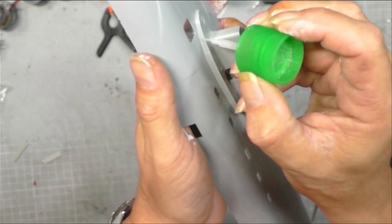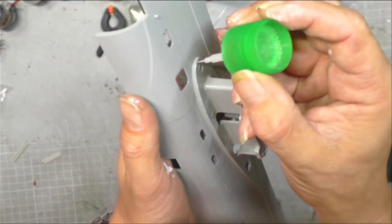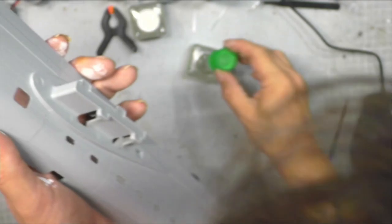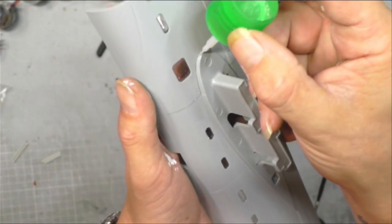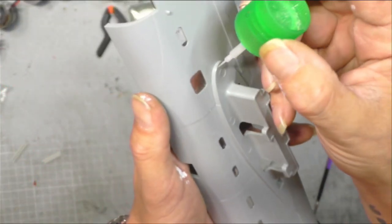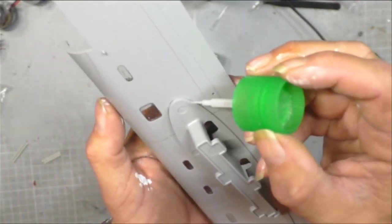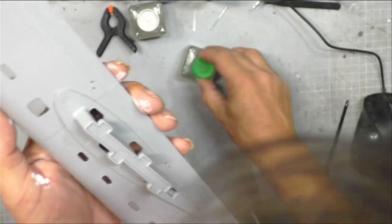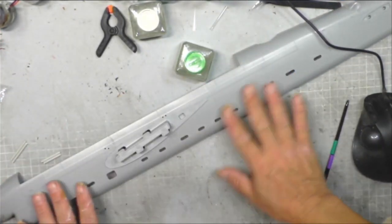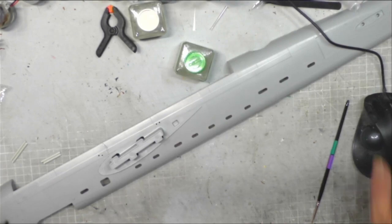That was quite nice actually, that capillary action, and this might act as a very slight filler effect. We'll see. That hole there is actually taking quite a lot of glue, so we'll give it a lot of glue. There could be a gap underneath. Okay, don't be frightened to use the glue. Okay, and I'm rather happy with that. It doesn't look perfect at the moment, but we'll try and tidy that up. But what we'll do is give that a good hour or so, laid down on a flat surface, just to give that time to dry.